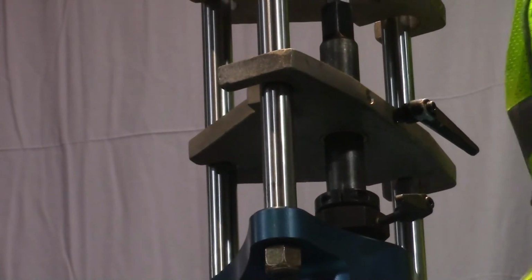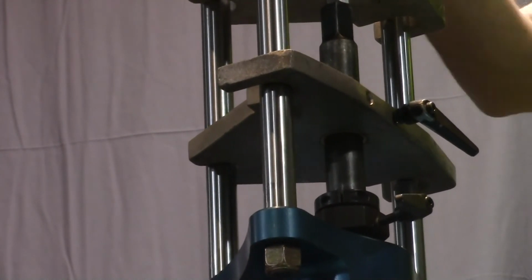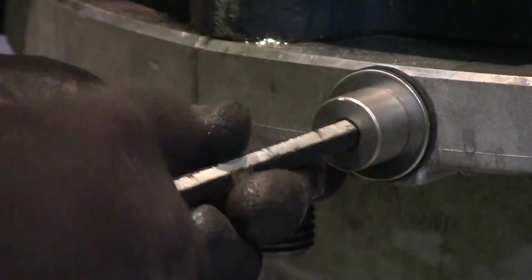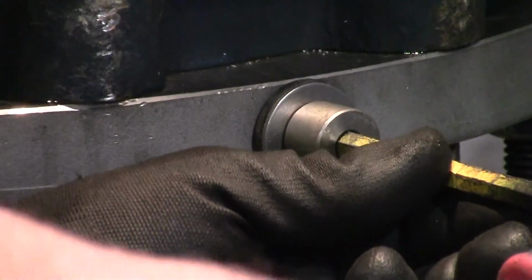The valve cartridge assembly is completely seated when the bottom of the stop collar contacts the top of the packing nut assembly. Lock the valve cartridge assembly in place by tightening the 6 Allen head completion pins. Tighten the pin until snug.